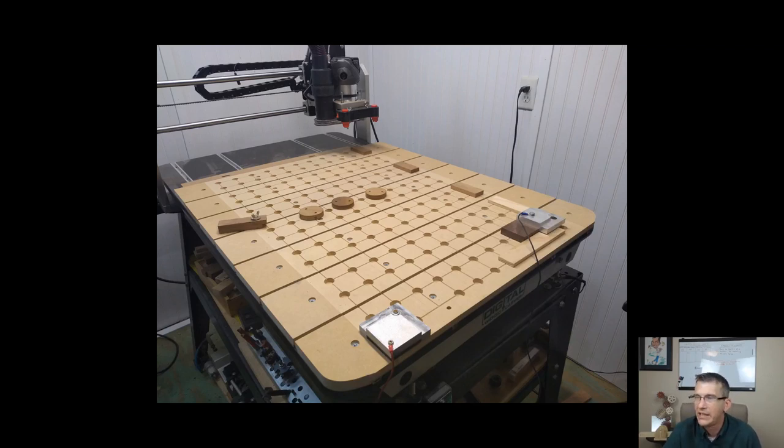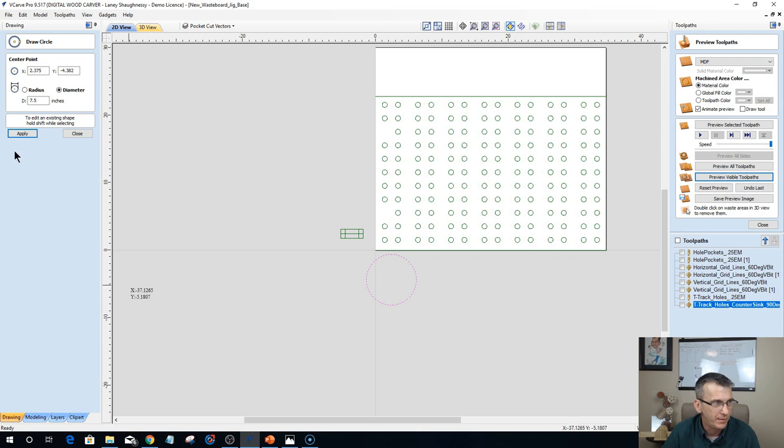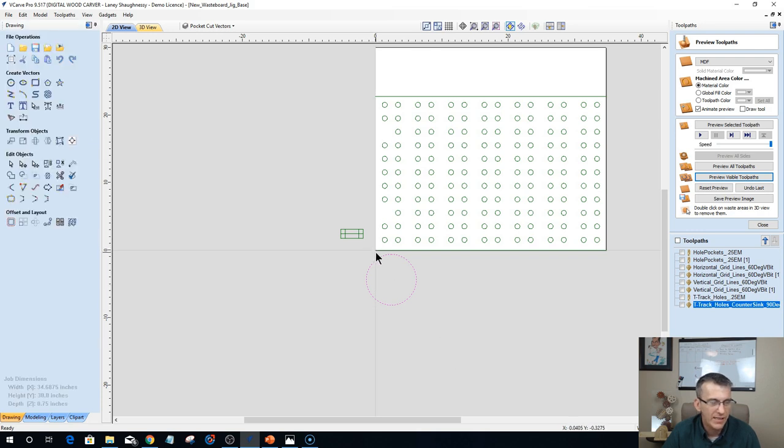So depending on your CNC, Jeff, for the digital wood carver, the operator's standing position is on the right side of the unit. So right here between the wall and my unit is Y minus, sorry. X minus is here at the front of the table. Y minus is here. So the operator's standing position is here. So if that's my X minus Y minus, if we were to look at the Vectric software, imagine this is me standing at my machine, my X minus Y minus is my bottom left corner here, but in the picture it shows as the right corner.